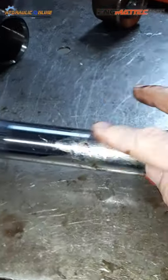Double acting seal. All right, so there's a lot of movement there. So what takes up all this movement? It has some counterparts that keep it centralized in the piston. And these two are the first two on each side of the main seal. So that will take up all the space. All right, just move it that way. Okay. So it's almost like a backing ring, but it's a backing ring on either side of the O-ring, right? Yep. And then what else?